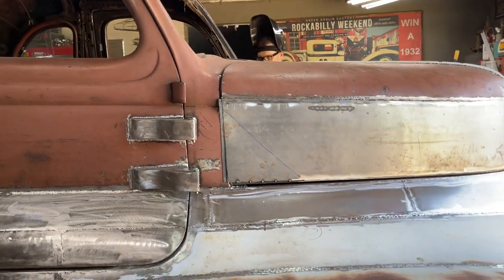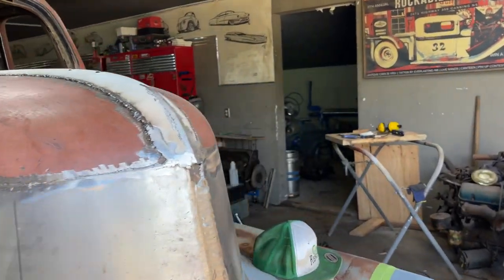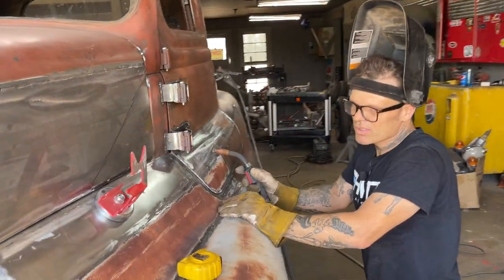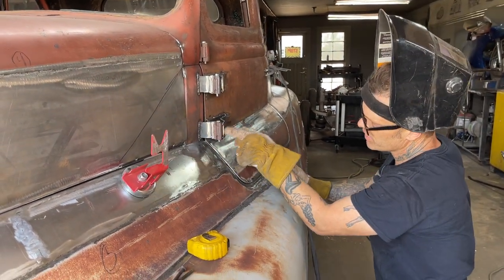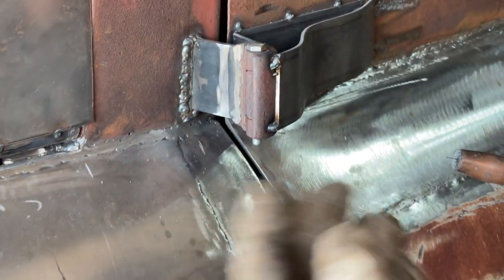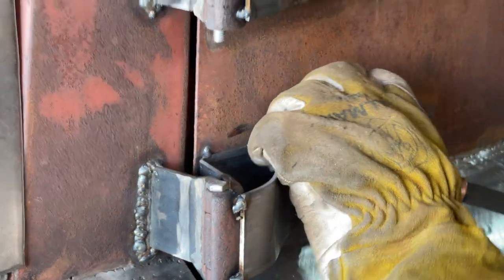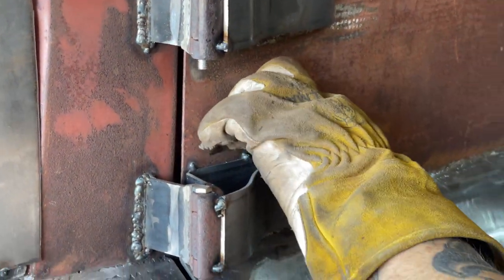So sometimes you really have to, you know, sometimes people say, well, wow, that welding looks terrible. Well, sometimes the welding is done to make it look better when you grind it, because you know you're going to grind it. You can see that edge there. I could spend a bunch of time trying to flatten it off. But I can just MIG weld and put a bunch of weld there, grind it off. You never know it was there. Bob's your uncle and Peter's your regular.